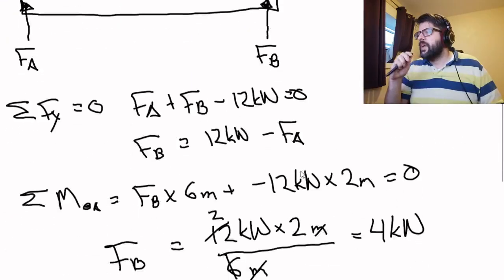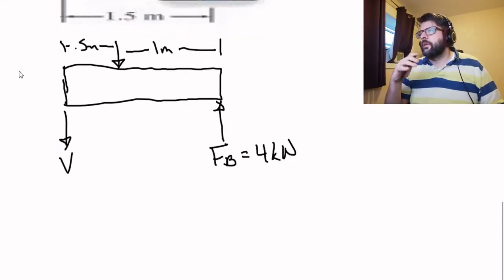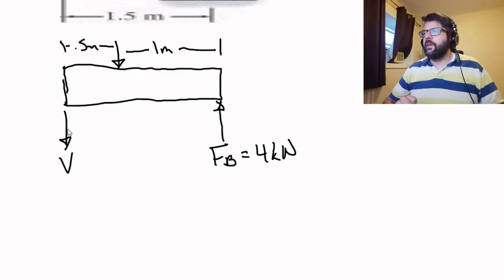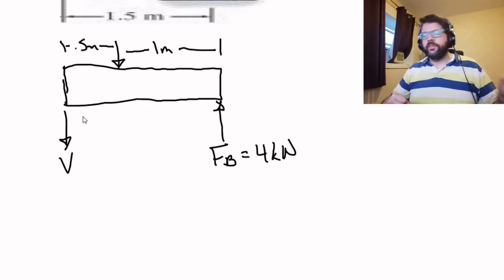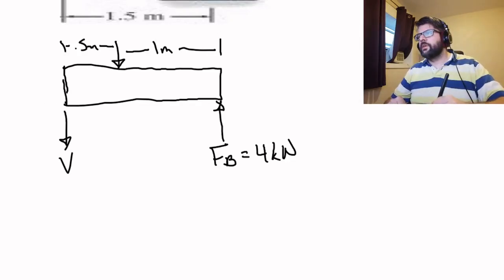So there is going to be one at that point. In addition to the shear load, there's going to be some sort of weird distribution of axial load that cancels out on this face. There's not going to be any net axial load, but there's going to be a distribution of positive and negative at various different points that causes a moment. So I'm just going to assume at this point that it is acting in that direction. We'll call that moment D.